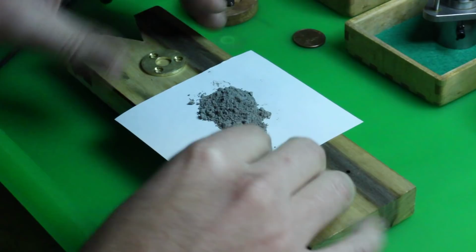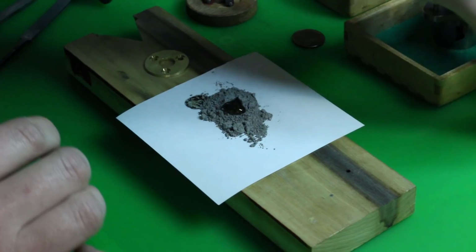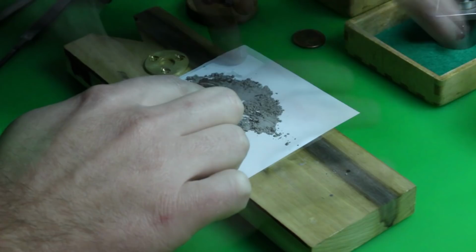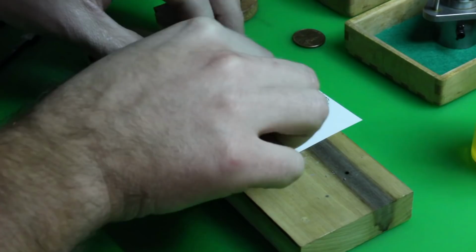For finishing the retaining plate, I had first decided just to clean up the surface a bit on a fine abrasive stone. I wasn't even going to mention finishing of this part in the video, but I really wasn't happy with the appearance and decided to polish it with rotten stone, a substance probably familiar to some woodworkers, but also traditionally used by clockmakers for finishing brass. Rotten stone is a very fine dust that, when mixed with some light oil, forms a mild abrasive paste.